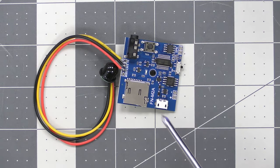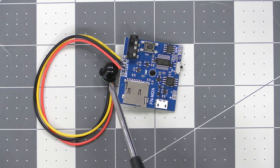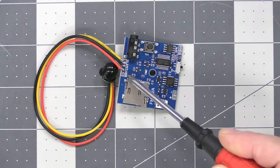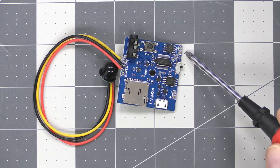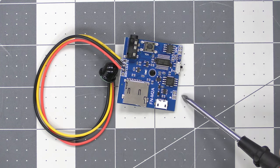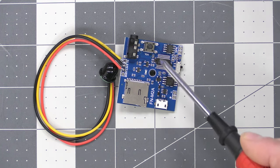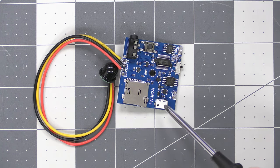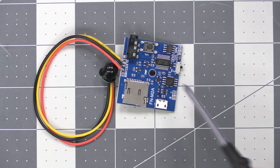All right, we're zoomed in real tight here so I can go over everything. Here is the tiny little motion sensor right here. Right here, you can see the hole for the pin for the busy signal. Over here are the two holes where you can put pins for the speaker mount. And down here is the auxiliary voltage in. This will run off of the USB power, so you could just use a brick and plug a USB cable in here, and this would work as is.